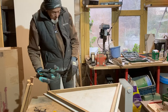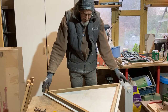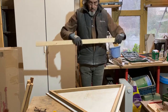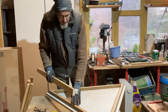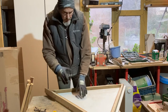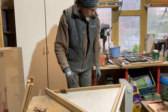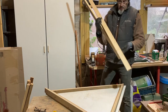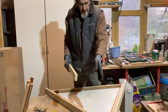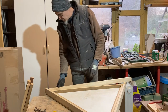So this is my hexagon shape. The outer dimensions are the net dimensions from the 3D model, and I now put up these guides for making the final triangles. If I put the cut beams onto this, it should come out exactly to the net dimensions. So now I need to cut the angles for the beams to make sure that everything is working fine.